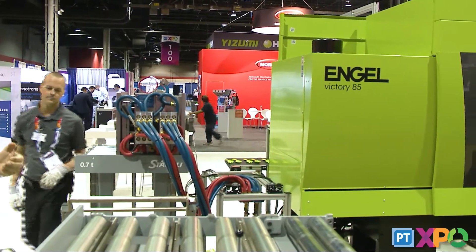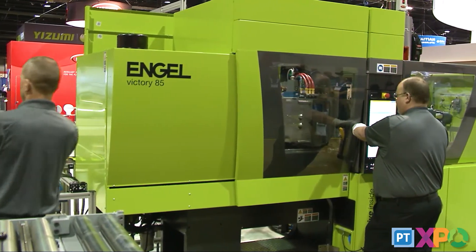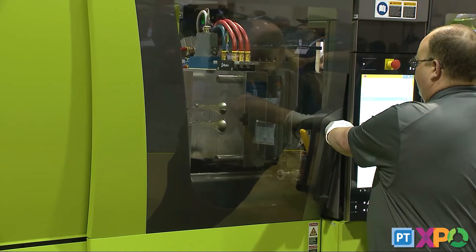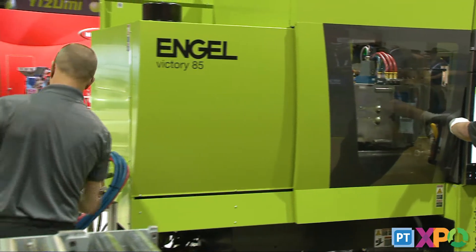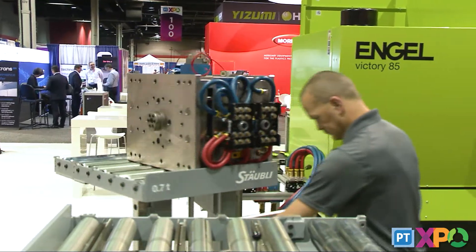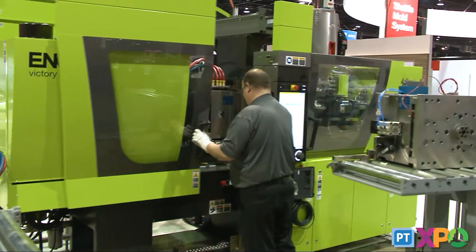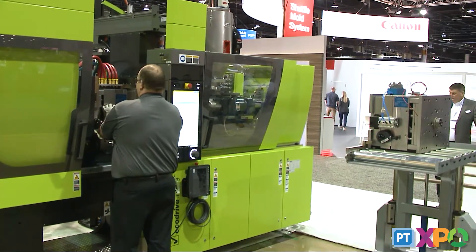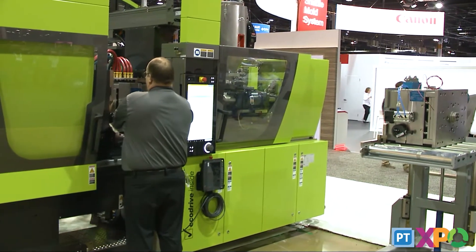The next step: once we know we have enough time to get this ready, we start to shut down production on the existing press — the existing mold that's running. Everything is staged onto the cart; the cart is prepared to be put in place. Some thought has to be given to your motion, especially if you don't have a lot of room, so you want to have the next mold to the side so your empty cart can go in first and you don't have to do a lot of juggling of the mold carts.